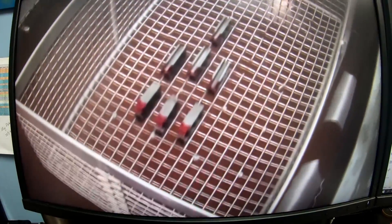The next one is the ultrasonic bath. The inserts on the ends are painted red so you can see how it actually works. When you have inserts or small parts that you want to put into a mold and you can't get them really clean, using an ultrasonic bath works a lot better. You set them in there for a few seconds or a few minutes, and it will eat off anything that's not metal — corrosion and deposits. A lot of people use this for insert molding; you'd use the ultrasonic bath for the smaller little parts.